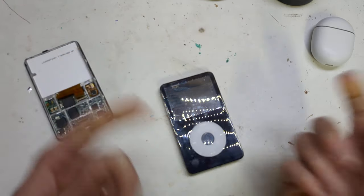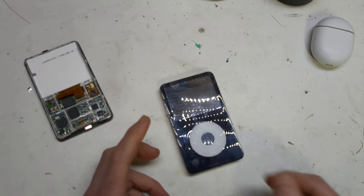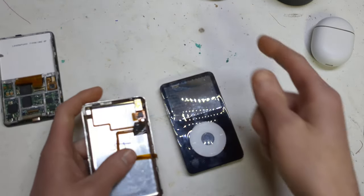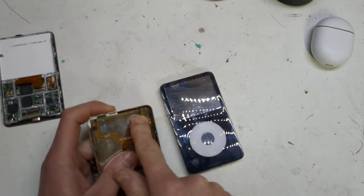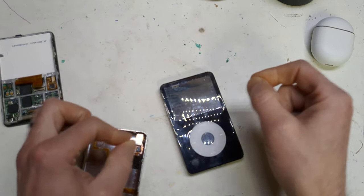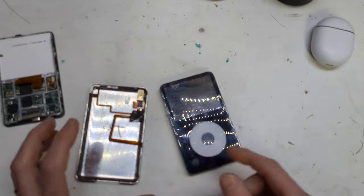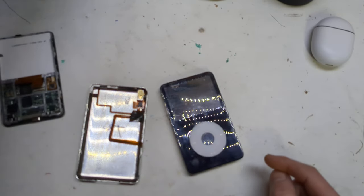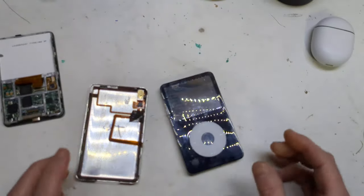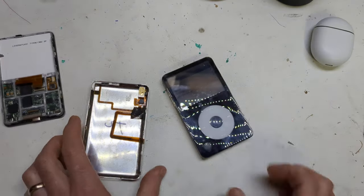I found a little tiny Bluetooth dongle — the kind that's supposed to go into the USB port on the back of your telly, and it comes with a little headphone male-to-male lead. So basically what I did was took it out of the dongle, chopped it down a bit, and wired it all in. I kept the headphone jack on the dongle, plugged it into both ends, and then with a multimeter I could map out which points go to where. Then it was all just wiring it up with some thin magnet wire — quarter of a mil. Wired all that up to a few points and yeah, it worked.